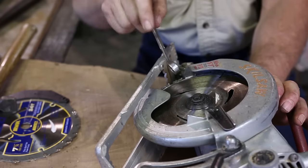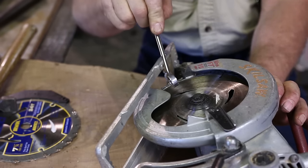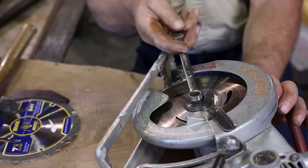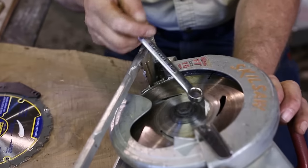You're going to figure out whether the bolt that tightens the collars onto the blade is right-hand or left-hand threads. On a worm drive Skil, they're left-hand threads. There's a little arrow on there which indicates which way you should be turning that to tighten it up.